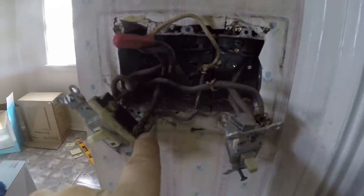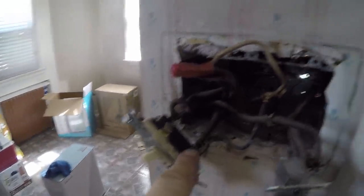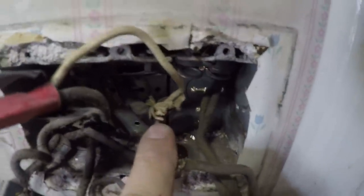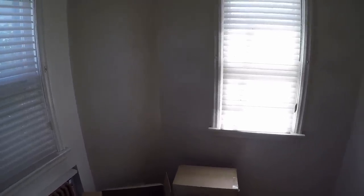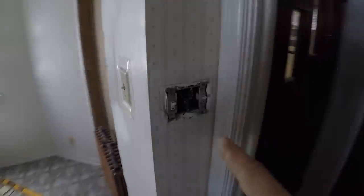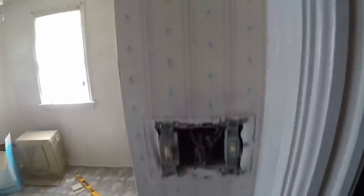So this newer wire, that black one right there — see it picks up a neutral here and then picks up a hot right here on this three-way switch, and the ground is just cut off. I've got a four-way switch system to put in today along with six recessed LED lights. We're going to have a switch here next to the future door. This mess here will be switched. There's a lot of weird things going on up in here.